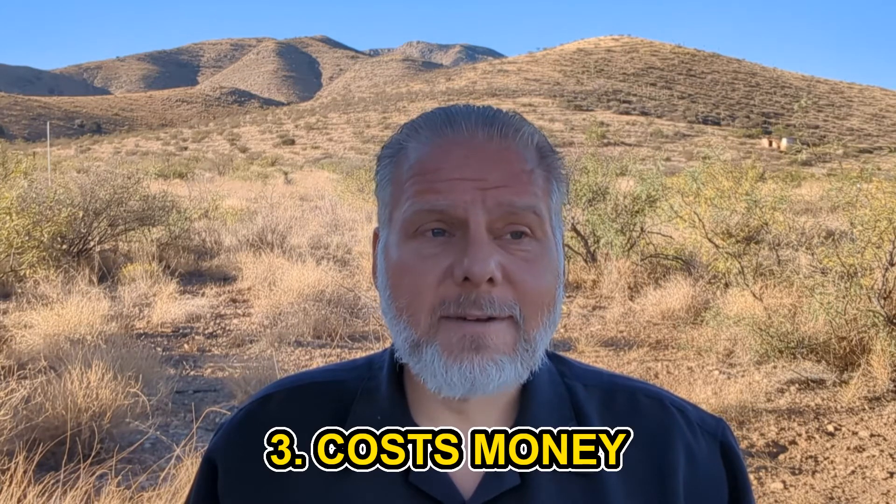The low cost of earth bag construction is mentioned a lot, but is it really as cheap as it sounds? Looking around right now, the cheapest I can find bags for is around 40 cents a bag. A simple 500-square-foot round home with walls about 8 feet tall will use around 770 bags, so that's around $310 just for the bags — about how much the 2x4s would cost to build that same size home with stick construction. Earth bag also needs barbed wire, stucco, and plaster on top of that. The costs between the two are not that far off, and traditional construction might be only a little bit more expensive but one-tenth the work.